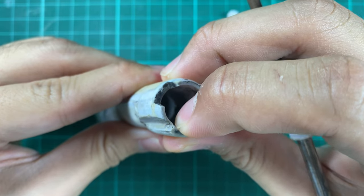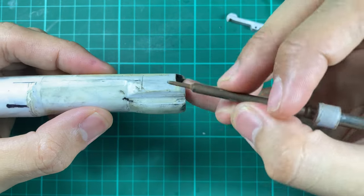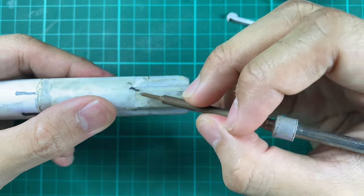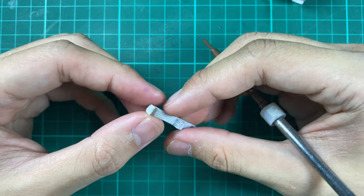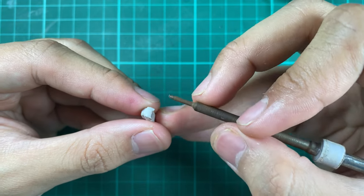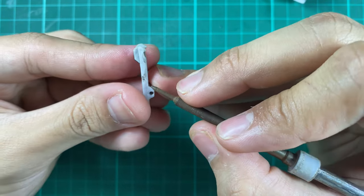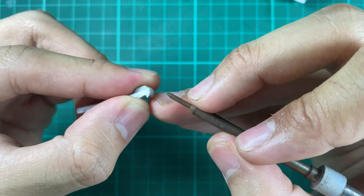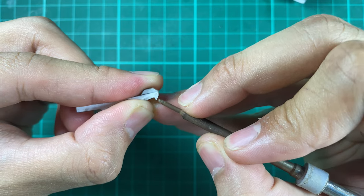I'm not going to remake the whole bolt body — I'll remove the filling and reapply a super glue and baking soda formulation. For the extractor, I fixed it during the first firing and tried again for the second, but it's simply too weak. I'll make a new extractor and make it beefier — protruding a bit more and thicker in general. The piece also bent after firing.